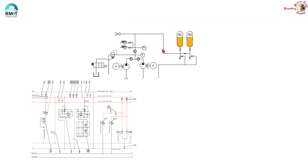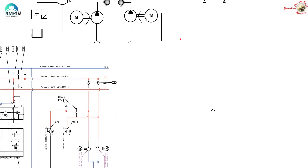Let me just quickly show it to you. When it is now unloaded, and my pressure falls to the cut-in pressure, my solenoid just shifts here, closing this drain. What is happening? The pressure here will lift up the spool, and then the oil from the pump will go back inside the accumulator. So this is a very simple way of loading and unloading a cargo operating circuit, which may be found in 50% of the ships we are sailing on.